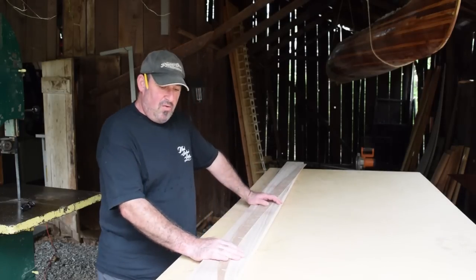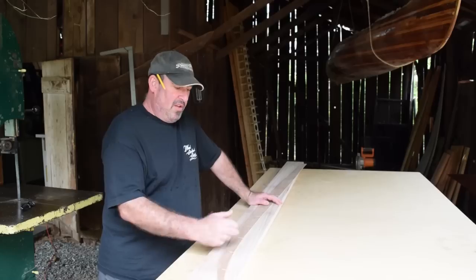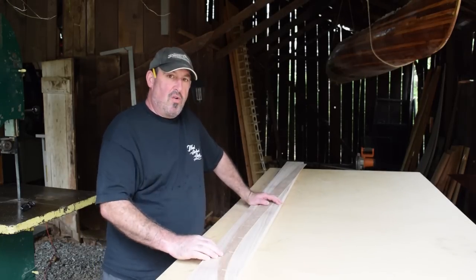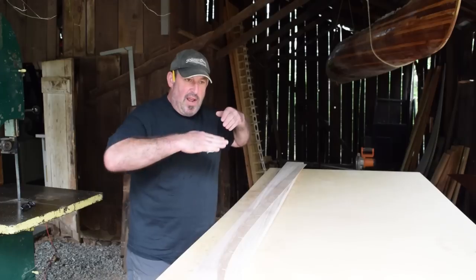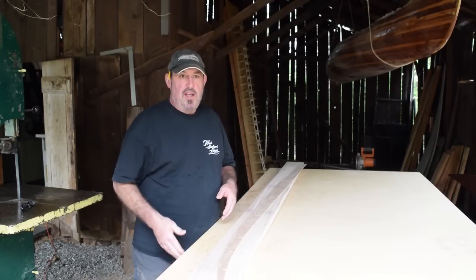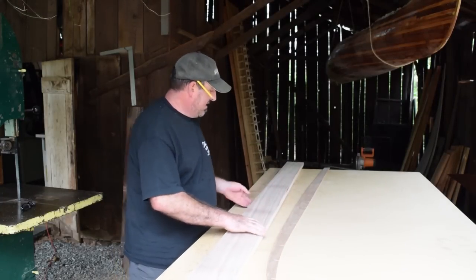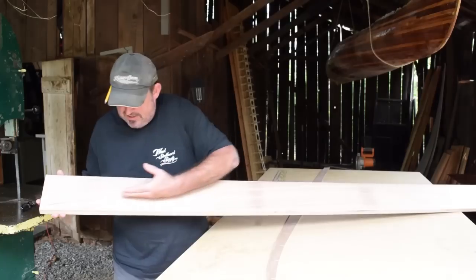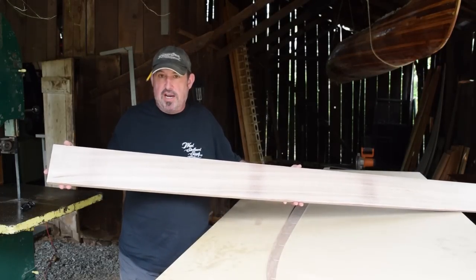All you needed to do was cut it the right shape — it's just so simple. Now the other best woodworkers on the planet might be thinking: the problem with cutting that way is that you're cutting slightly across the grain, whereas if you rip a board on a table saw or bandsaw with the grain 100% and then bend it, you have grain that flows through and can be stronger. But unless you split the wood and then bend it, you still have grain running off and opportunities for breakage. So I found a piece of paulownia where the grain is kind of running the way I'm going to go anyway, so this is going to be just as strong as if I had ripped it straight and then bent it.